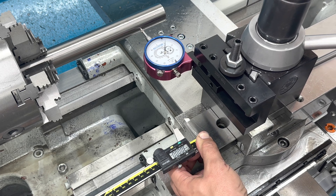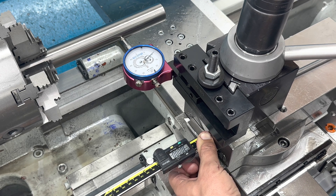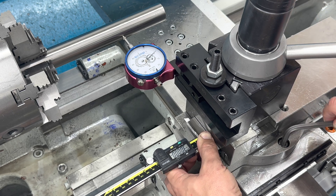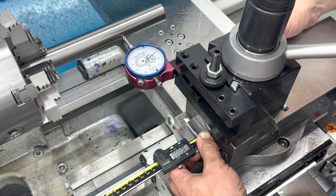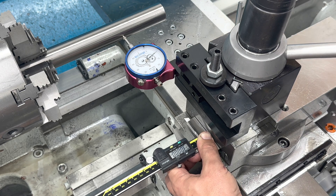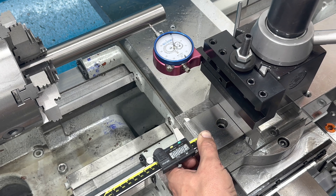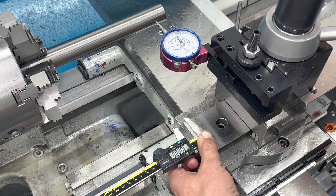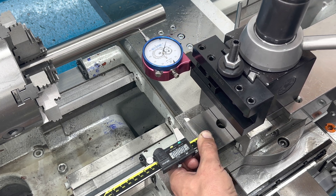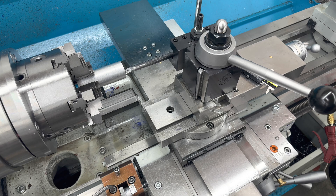You just go back and forth until you get the reading you desire. Go back in to zero — okay, we're getting closer. Actually, that's it right there. I'll snug this down. We're going to back it up — when we hit our stop it should be zero. There's zero. Go in, and when we hit our caliper set at three inches, it should read 10.5 thousandths. Some little tricks here — I always set a carriage stop.